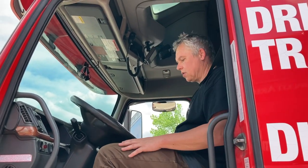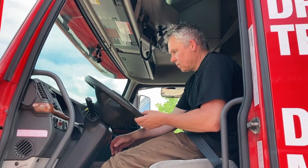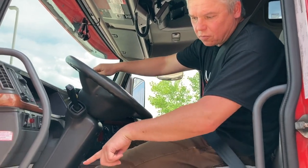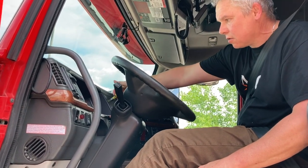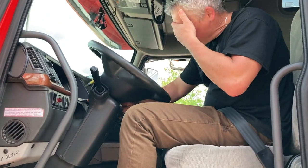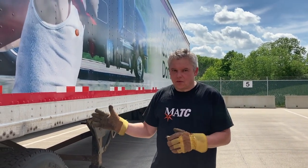First I'll perform a safe start. Now I'm putting the transmission in reverse and releasing the tractor brake only — so the tractor is free to move. Watch as the tractor pushes slightly backwards. Now while the tractor is pushing, I set my brake, go back on the clutch, put it in neutral, and we're done. Now I'm ready to uncouple the tractor from the trailer — the pressure is released from the locking jaw so it should go easy now.